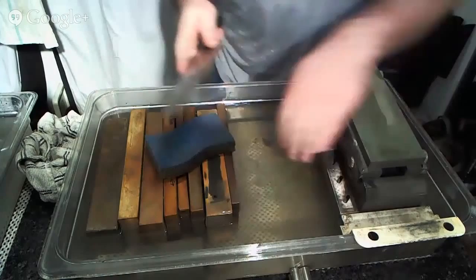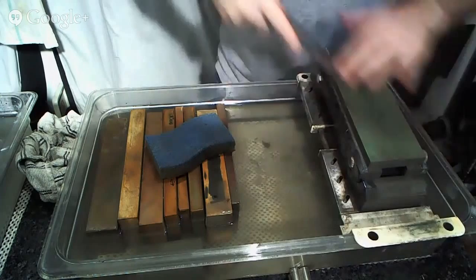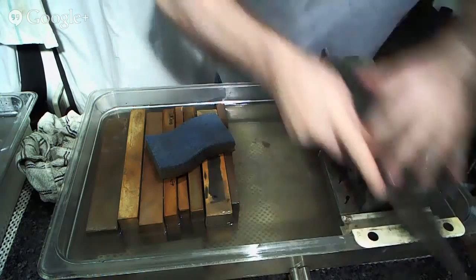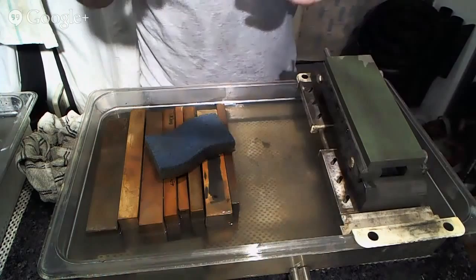It's kind of convenient that I had some time for this tonight, so I'm glad that you guys can participate in this as well. So again, the 1,000 grit stone this time is just about removing the scratches from the previous grit stone. We've already created and formed an edge. We created and formed a burr. We are looking to make sure that the scratch pattern on our bevel is the way that we want it to be, that we're getting the level of refinement out of it that we want, and that we're reducing and removing the burr as we go through our sharpening process.